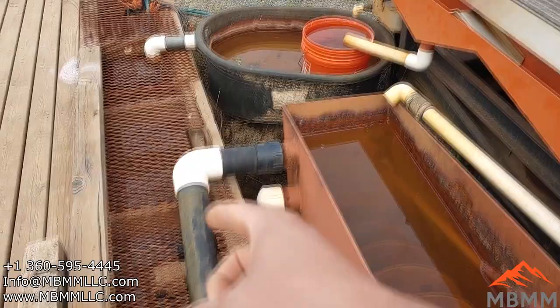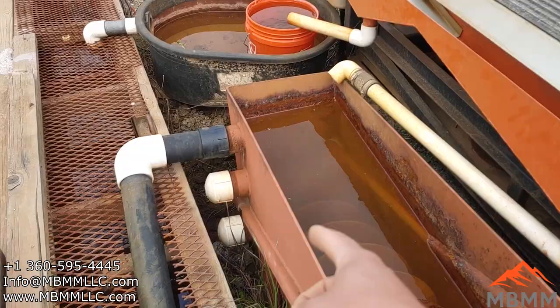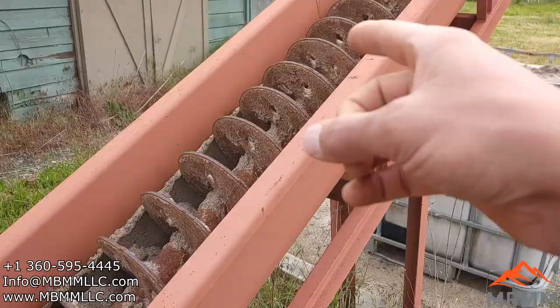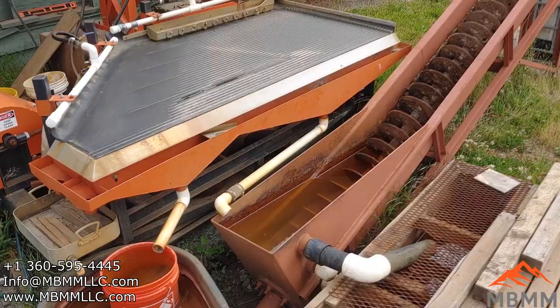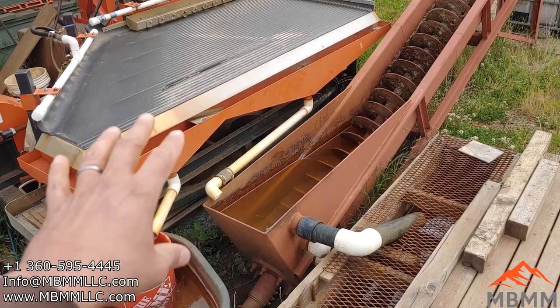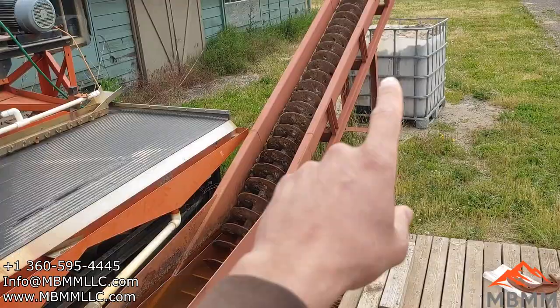So you may only have the 1,000 mesh pieces of gold or smaller going out into the tailings pond. Even if you have liberated gold that the shaker table doesn't catch for some reason, it's still going to settle down into this catch basin and auger out with the oversized quartz tailings. The spiral classifier is really useful for separating the tailings by settling density — essentially settling velocity. The oversized stuff comes up here for regrind and the fine stuff comes out here with the water.